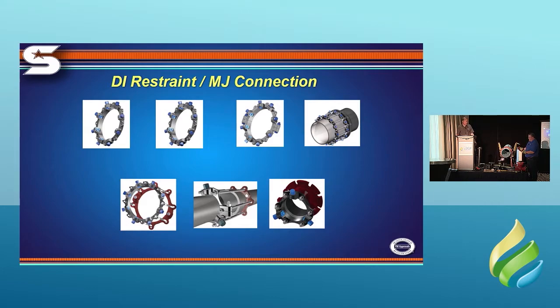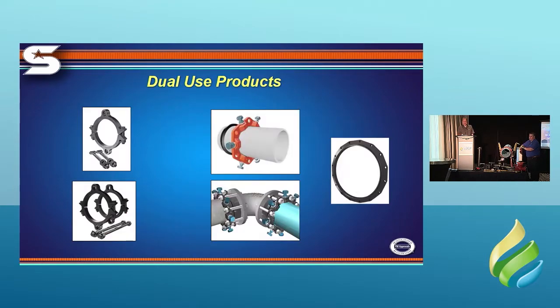If you're putting a ductile iron one on a steel pipe, which it can be used, there's no washers to remove in there. That's just because the material is hard enough that these break-off nuts will just break off when you tighten it up hard enough. The plastic pipe, the PVC, it's not tight enough. You can keep tightening it down. So if those washers weren't in there, you'd penetrate the wall of a C900 pipe and you'd stress that pipe, and over time it could lead to a failure. Depending on the diameter, you could quite exceed how far you go in. You would hourglass the pipe or narrow the pipe.